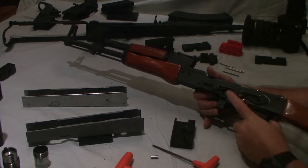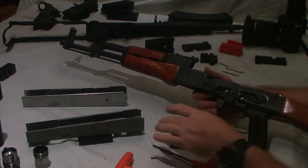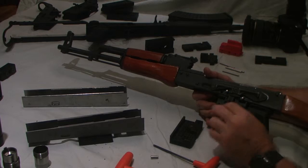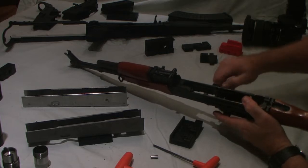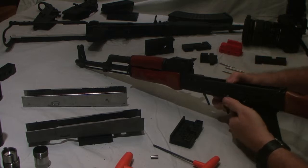Now if you'll notice when I pull it off, there are two dowel pins in place. Those are 5mm, they extend through from the other side, and they are captured in the two 5mm holes. That maintains the concentricness of these holes. So that's that side — and I pull these things out of here. It's tight, like I say, for good reason.